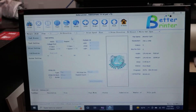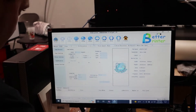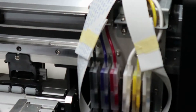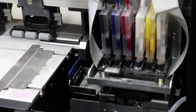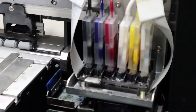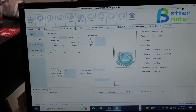Alright, in the print software for this XP 600, you can see up here — we're going to go ahead and hit the clean button and do a normal cleaning. During the normal cleaning with a DTF printer, it's going to do a flush out, forcing ink through the head, then come over and suck out of the docking station, then do another spray out of the nozzles, and then reseal itself. We're going to go ahead and do another cleaning — the same thing. Typically when you start for the day with DTF printing, you're going to do two to four cleanings every time, and that's very normal. We'll do two for the maintenance here.